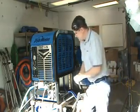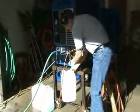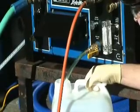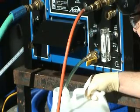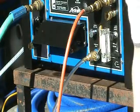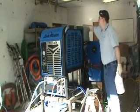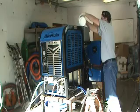And we'll place the hose on the outlet valve for the water box assembly. It's important to drain the water box down to a level about half its volume prior to descaling. Okay, once we've done that, we shut the valve back off. We'll take our descaler. We'll open the lid on the top of our water box, and then we will pour the manufacturer's recommended amount of descaler into the water box.